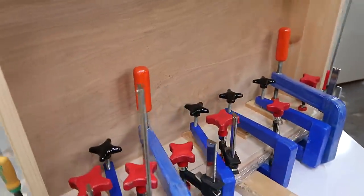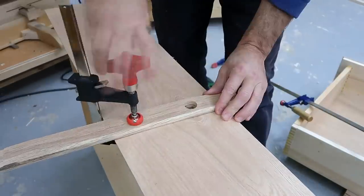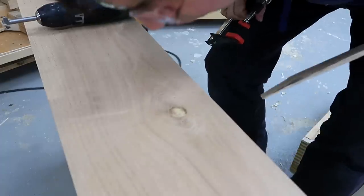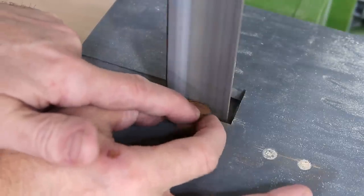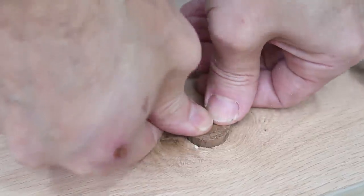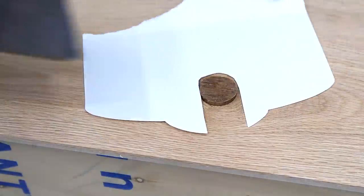I can only glue up one of these at a time, but that's okay — I've got other things to do. It seems to be fashionable for YouTubers to get sponsored by Total Boat and use gobs of epoxy to fill in defects, but I'm old fashioned, so I'm making a plug to fill it — using a dark piece of mahogany. That way the knot will still show up, because in three of the veneers the knot stayed in place.